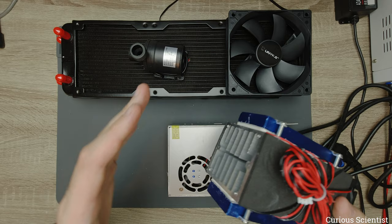First I'll leave the fan unplugged and just let the Peltier coolers run, to see how cold the heatsink gets without any airflow — I want to show that the heatsink can drop to quite low temperatures, possibly below zero. Once I turn on the airflow, I'll be pushing heat toward the cold side, which will load the Peltier coolers and raise the heatsink temperature. Higher airflow will bring the outlet air temperature closer and closer to ambient. Let's do the experiments.